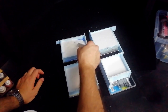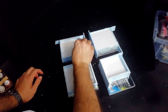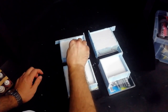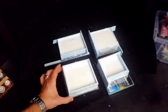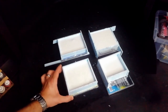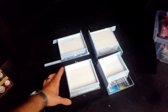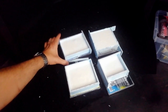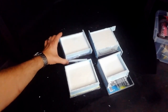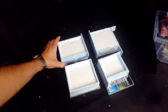The silicone must be poured only after you are sure that you have mixed the activator well with the silicone rubber. The drying process lasts several hours, so take your time and try to mix as well as possible. The silicone must be poured very slowly with the liquid thread from a height of 20-30 cm. This reduces the possibility of the inclusion of air bubbles that could ruin the mold. It is usually possible to add silicone within the first 10-15 minutes after the first pour.